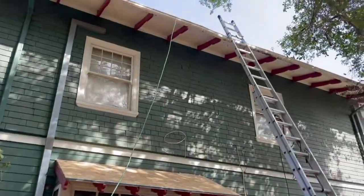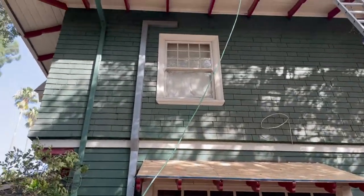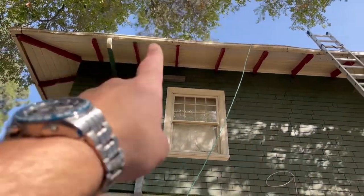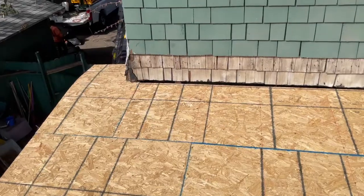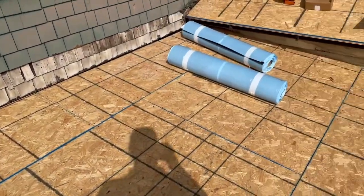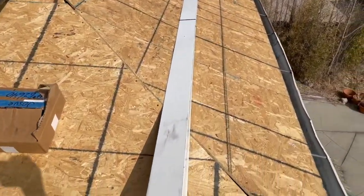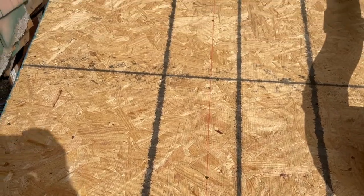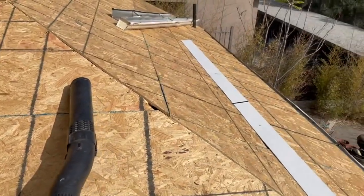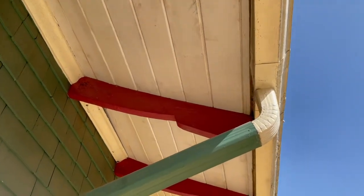So this is our job site here. We've got a generator going, our compressor is running. They're about three days into this job already, so we've already torn off the old roof, installed new plywood, and pretty much we're doing some prep work now after replacing the wood prior to the installation of the roofing. Over here on the back, there's a little patio addition with a flatter roof. We've installed new OSB sheeting all across the roof because the old roof had wood shake. When we tore it off, we had to install new OSB. On the edges, you should be at 6 inches on center, then 12 inches on center on the fields.